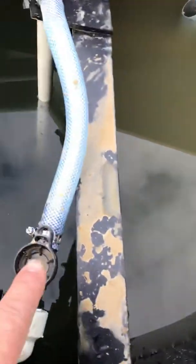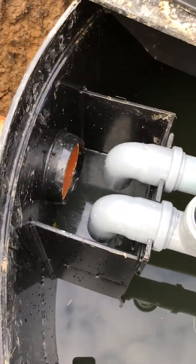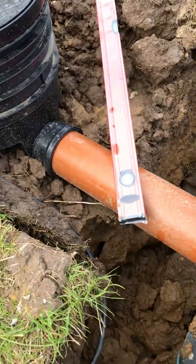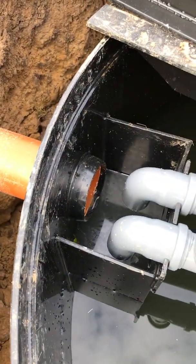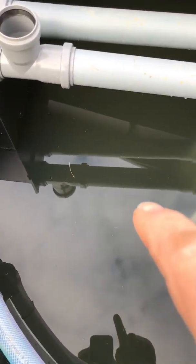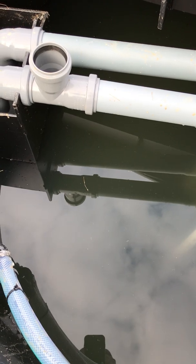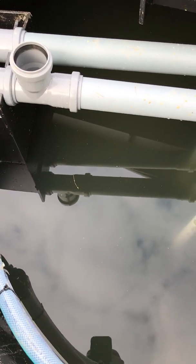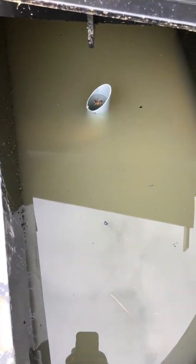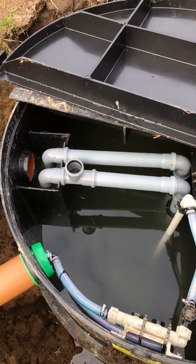This one here is the primary airflow, which bubbles up in there — you're supposed to make it look like it's boiling up — and any effluent including any little solids go out and end up in that little chamber and get pretty much broken up by the heavy bubbling. This is aerobic because there's a big air bubble underneath. Over here you've got an anaerobic zone where all the sludge comes in, and the sludge return gets pumped back around there. The idea is it needs some carbon on this side to completely break down the waste matter.